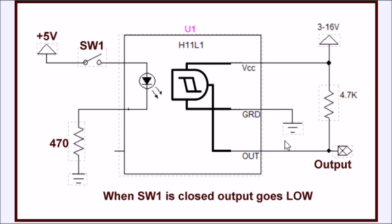You really just have three output connections, but you do require 3 to 16 volts. There's a ground and a digital output, and this is a clean square wave due to the Schmitt trigger. This is just a test circuit. This is handy for noisy signals that may cause problems for an Arduino or whatever you're feeding it to to read.